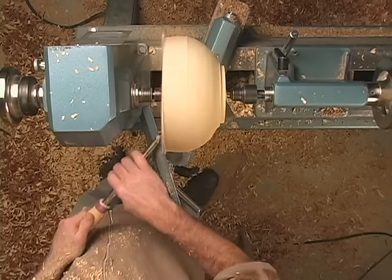And my sweep is straight. That's exactly what I want. Let's do the other side. The heel of the bevel makes contact first. Roll it into the cutting edge. There we are. Now I'm sharp. Drop the tool handle. All the way to the nose. Now I've blended in a nice consistent bevel